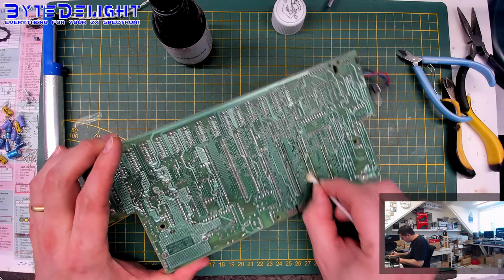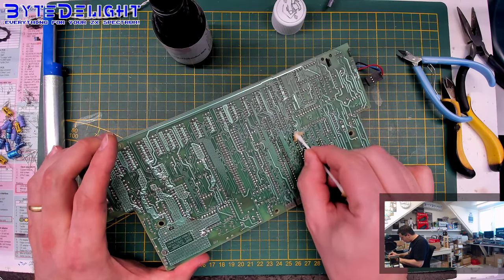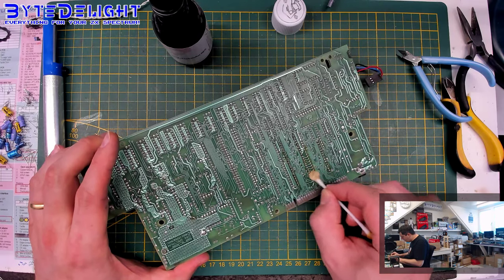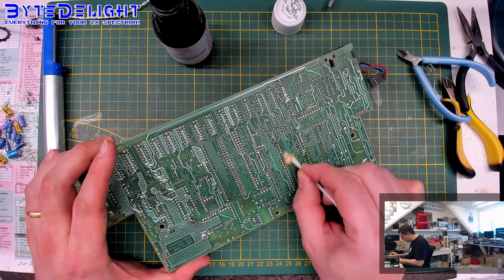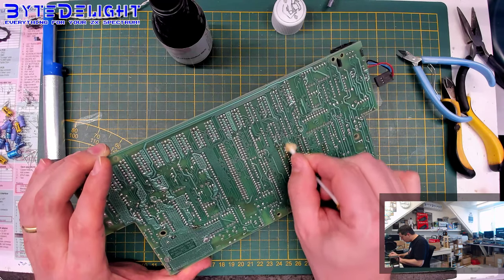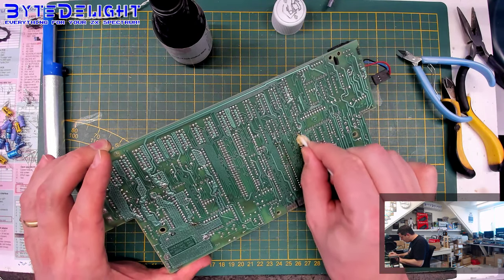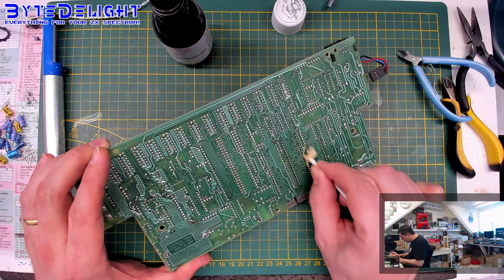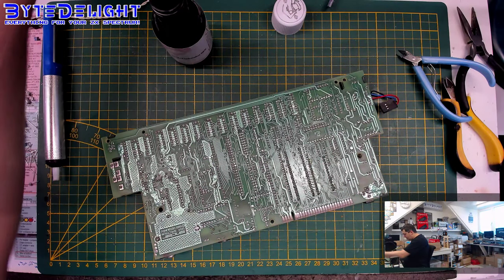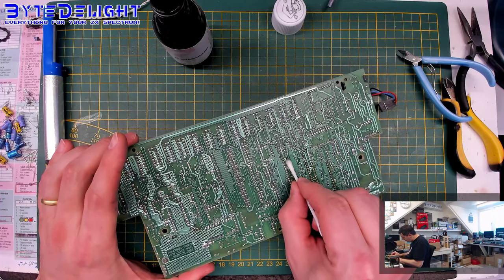Fortunately, there are millions around, so if you need a replacement Z80, it's easy to get one. Just make sure that you're using an NMOS type for these original ZX Spectrums. That can be a bit tricky, because CMOS will work, but not very reliable when it comes to add-ons. If you want to source an NMOS or CMOS, my experience is that they're all blacktopped and remarked nowadays, so you don't know if the part written on the silk screen on top of the chip is actually the part that you're getting. Fortunately, you can check if you're having a CMOS or NMOS type using Brendan Alford's diagnostic software. There's a feature built into the latest version to check if you are using a CMOS or NMOS Z80. But other than that, you cannot tell from the chip, because they're mostly reused old stock chips.